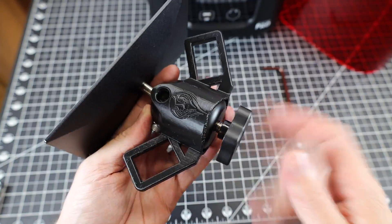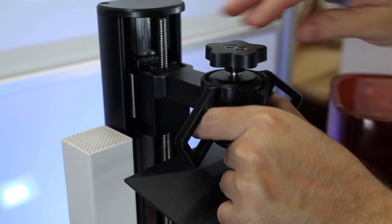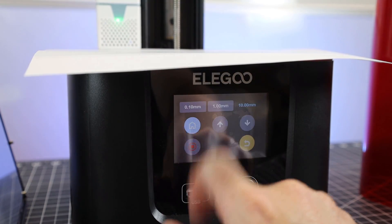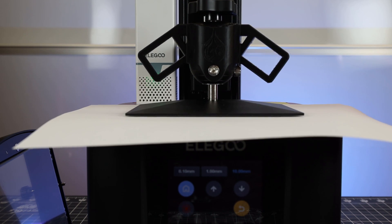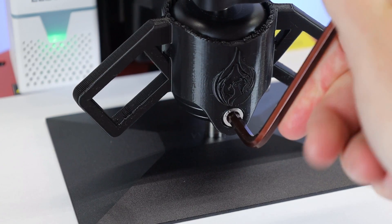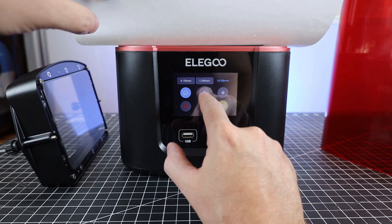They're really easy to install. You just have to take a couple things off of the build plate, snap it on, and screw everything back in. With that done, I'm just going to put the build plate back on the machine and level it, and I find this to be super easy on resin printers. You just make sure that your leveling bolts are loose, remove your vat and put a piece of A4 paper over your screen, and using the display on the printer, tell it to home itself, which will bring the Z-axis all the way down. Then just tighten up your bolts and pull on your paper just a little bit to see if it has a good amount of resistance — and that's it, your machine is leveled.